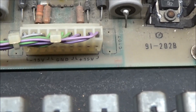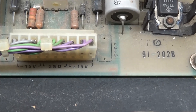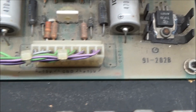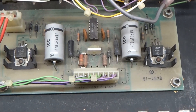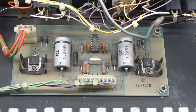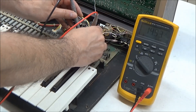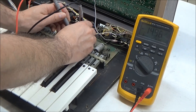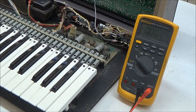You can see the rails are labeled — three of the pins are for minus 15 volts on the gray wires, the green wires are for ground, and the purple wires are for plus 15 volts. I first took this measurement with the cable disconnected — I didn't want to power it on and potentially damage circuitry if the power supply was faulty. Measuring DC volts, I put my black probe on ground, red probe on plus 15 volts, and I'm getting 14.93, which is fine. Moving the red lead to the gray wire, the minus 15 volts, I get negative 14.96 volts — so that's fine. There's proper power going to the synthesizer, no short circuits dragging the rails down. Our issue is not a power one.